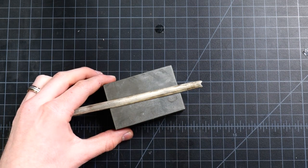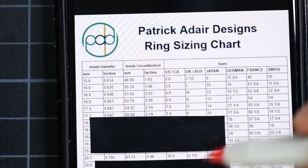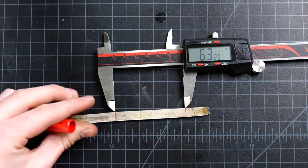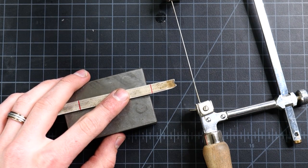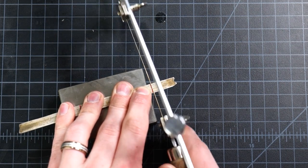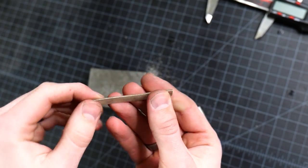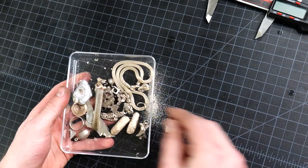We've got our flat stock all ready to go, nicely shaped. Now we need to cut it to the correct length for my ring. I'm going to pull up my ring size chart — I'll have this linked in the description. I want to do a size 10 and a half ring, so I need to go to the circumference. I'm going to use metric: 63.1 millimeters. If you don't have calipers, you can use a ruler. I'm going to use my jewelry saw for this, but a hacksaw or Dremel works great too — just trying to use whatever tools we have to do this on a budget. I'll save my scraps so we can do this again in the future.